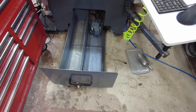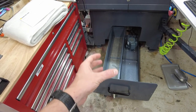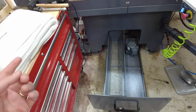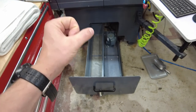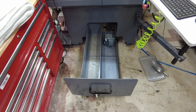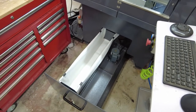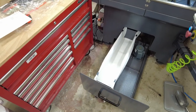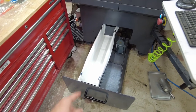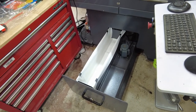The last upgrade of this video: I'm going to put some filter felt in that dish in that little collection area so that in the future there's better filtration for all the chips not going into the pump — especially because I'm running G10 and eventually carbon fiber. Also, I can just grab it all up, take it out, put a new one in, and it'll be easier to clean rather than having to deal with the whole tray coming out. I use basic clips to hold that in there. That's 25-micron filter felt — it's going to make it pretty easy to just hammock all those chips out of there in the future.